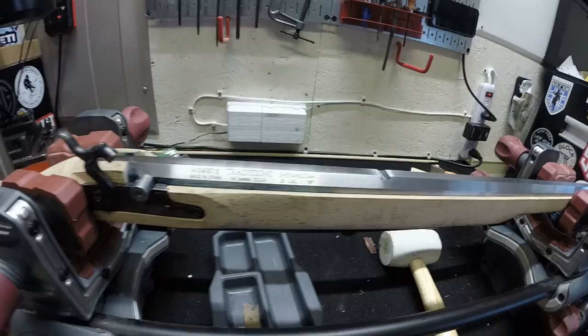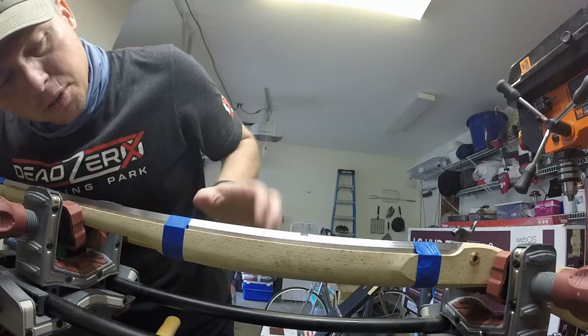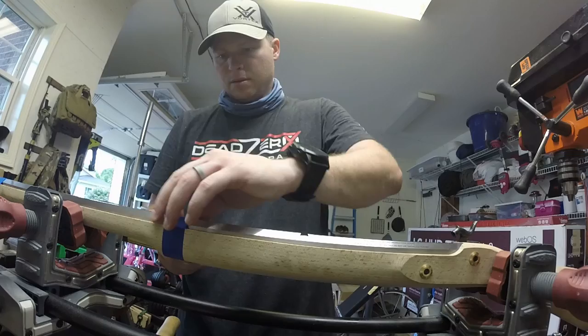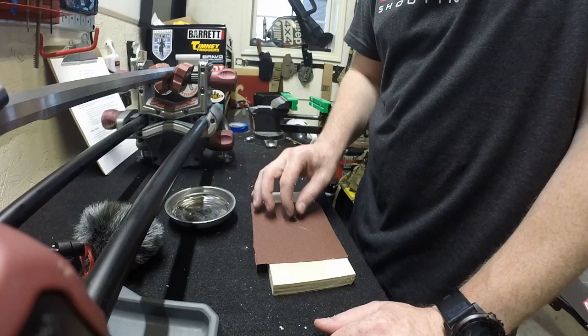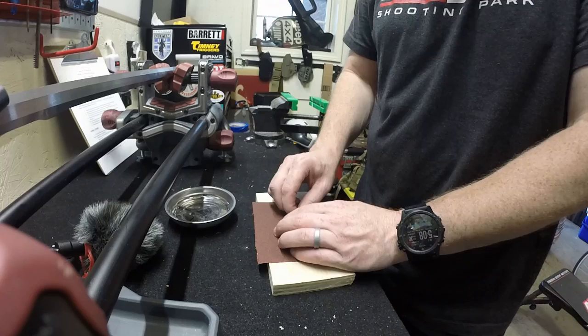I've taken the barrel into place and marked the edge of the barrel in relationship to the stock. I'm going to pull the barrel out, rotate it into place so I can start getting these tenons dropped in, and mark these tenons out. So I've flipped the barrel over to the bottom side and checked these tenons — they both need some work done on them. I oriented the barrel as suggested, moving right to left, and marked the smallest side to start with that side.